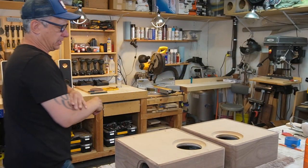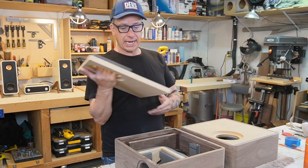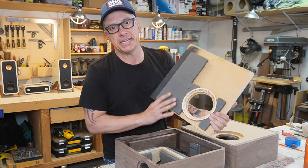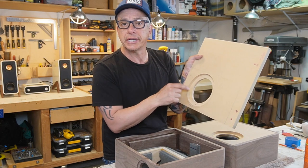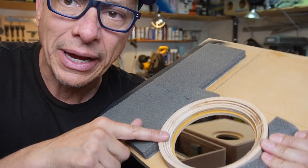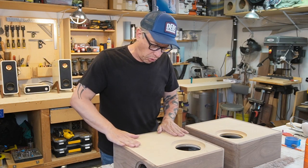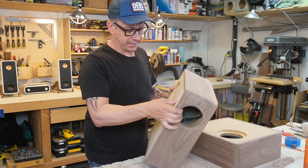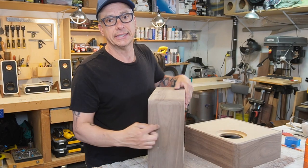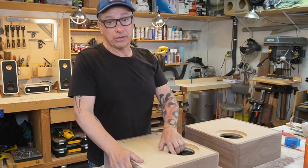Guys, so we have the boxes pretty much ready. We have the side panels with the foam and the inside ring where we're gonna attach the screws for the subwoofer. So we have the plywood here. I chamfered it so we have a smoother edge. The sides are gonna be all covered in walnut veneer, so that's gonna be our speaker. And maybe we are gonna add a tweeter here, an ambient tweeter. We're gonna listen and find out later.